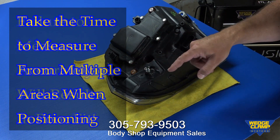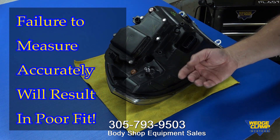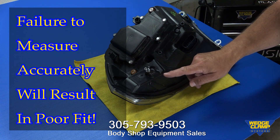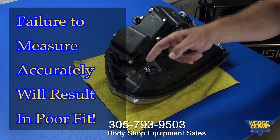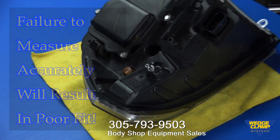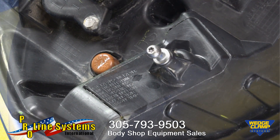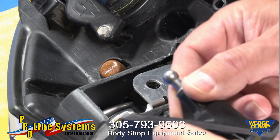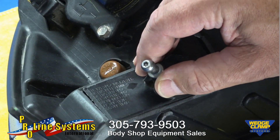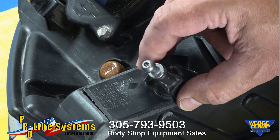What I'm going to be doing on this particular job, because there's sort of no access to the backside, is instead of just using the die grinder bit, I'm actually going to do a slight bevel all the way around just to allow the plastic welding ribbon to actually settle into shape. You can see a little bit closer here just what it looks like prior to the welding. We've got our edges beveled to about 45 degrees down to the base, and that's around the perimeter of the housing and of the part that we're replacing.